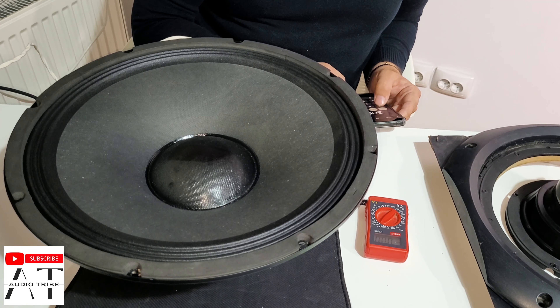With this 15 inch we get about 40 watts — same as the Logitech — because they have the same higher impedance. The bigger the subwoofer, the bigger the vibrations, but if you want to use all the power the amplifier can deliver, you must use a 4 ohm woofer. Bigger speaker means bigger enclosure. Subscribe to the Audio Tribe YouTube channel and please hit the like button — cheers!